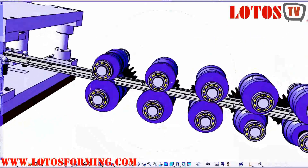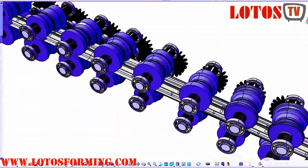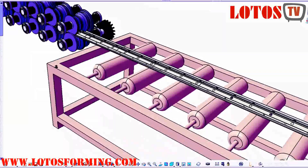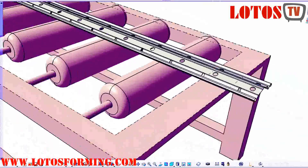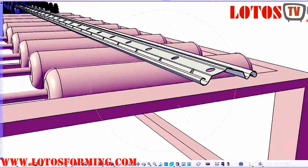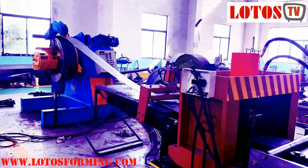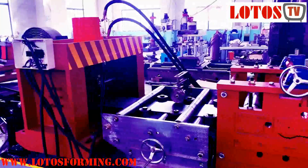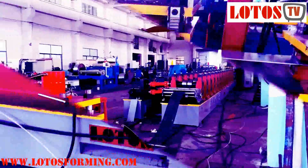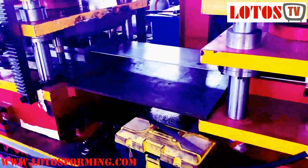The recorder shows cutting, then the material goes through the roll forming stand. Here is where the rollers start forming the shape. This design and these rollers are for a door shutter machine. It has 14 tooling stands and an output table. Here is the final section of the profile — you can see the hole and the punching shape. Here is the real machine we already produced for a high-thickness C-post beam machine, which has leveling, punching, and cutting before roll forming.